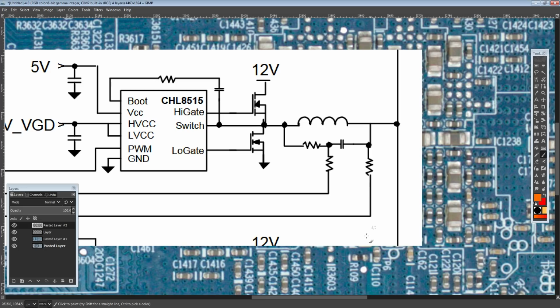So usually when I'm looking for something, say when I was volt modding Vega, I basically went, well, there's supposed to be a capacitor, and there's going to need to be some resistors with it, and it should have this kind of resistance to the output of the VRM. And that's how I eventually found the feedback lines for Vega. But this thing right here, we're not looking for feedback, we're looking for something that looks like this.